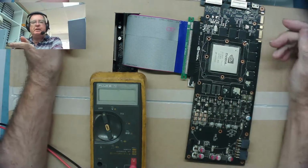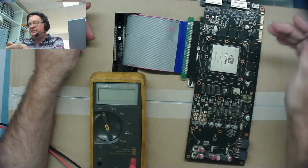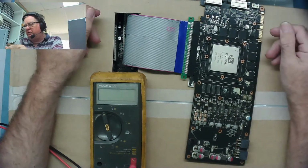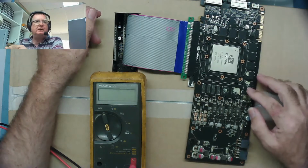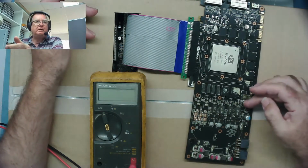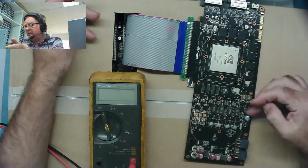So really, the only conclusive thing we have is the fact the voltage here is low and the resistance is low. Nothing in particular is getting warm or hot. But with 10 ohms, I mean, less than a volt, there's not a lot of current being drawn there. So I think we probably need to have a look here. First of all, is the low resistance on the load side or the supply side of the coil? Could be a problem with these FETs here, I guess.